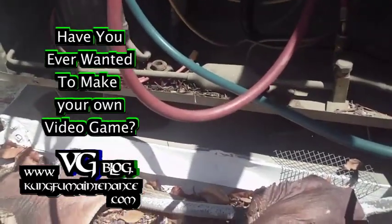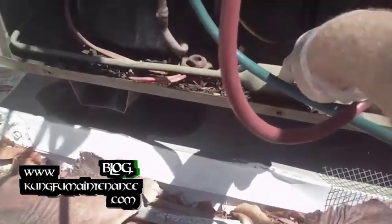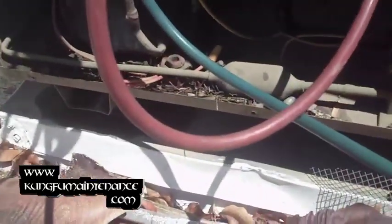The new unit comes with a filter dryer installed on the unit inside. You can see it there — a little bit different style, a little smaller one. This one's got three filter dryers on it, which is good, keeping the moisture out of the system.